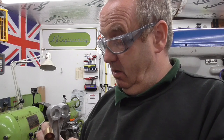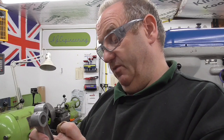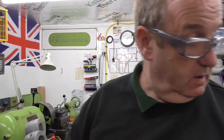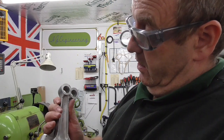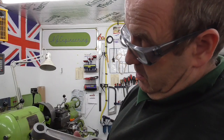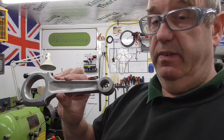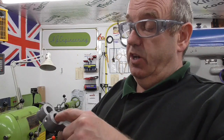I think the bushes are 811 and 812, something like that. No, 817, 818, that was it, thou on the OD. And the rod eyes on that one, it's 750, 751. That one is 753 to 755. So I'll set these up one at a time in the mill, and I'll show you how we do that, how we get them centralised. Quite simple when you think about it.